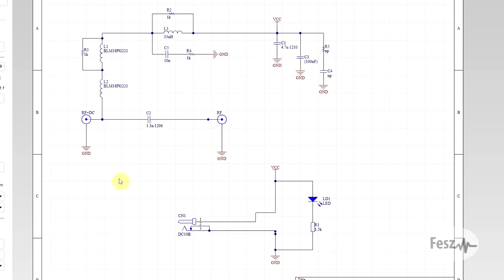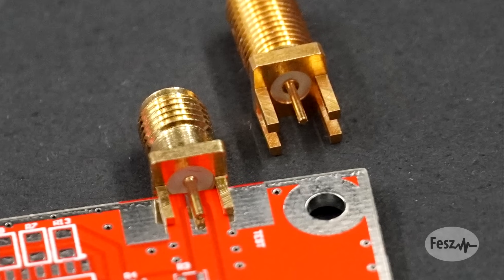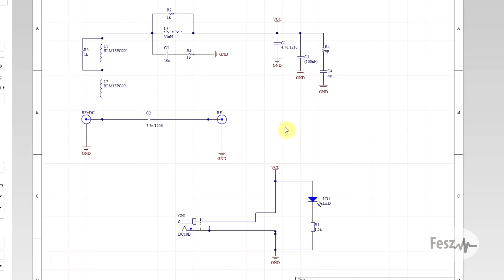This brings a very important topic into focus: any RF project, no matter how well designed and simulated, can be completely ruined by some bad connectors. So, to try and improve on things, I decided to have another go at making a BIAS-T, but this time specifically fine-tuned for high frequency operation. With this design, I wanted to do things a bit differently. First of all, two SMA connectors, both inline — not the 90 degree type. Then, I wanted to experiment a bit with the inductors, so I added two ferrites as well as a 33 microhenry ferrite core inductor, and in parallel a couple of resistors as well as an RC network. For the decoupling network, I used a large 4.7 microfarad capacitor, as well as a bit of room for some other components. Finally, I added in an LED and the supply connector.